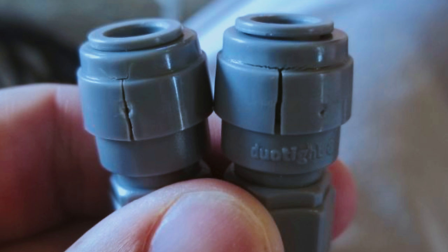This damage was found to be caused by acid-based sanitisers such as StarSan and Kegland's own StellarSan that have been applied to the entire fitting instead of just the internal parts. Now technically there is no single reason to actually sanitise the outside of such fittings as only internal sanitisation is needed, but clearly this was becoming a widespread problem, causing cracking and failure in such fittings when such sanitisers were left to dry on the exterior.